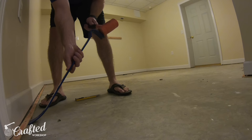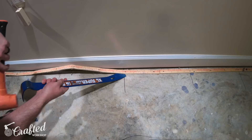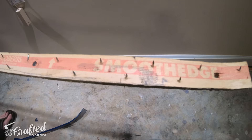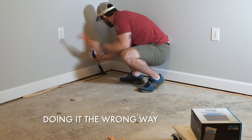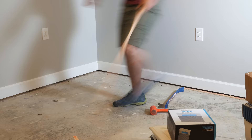These things are kind of a pain, but there's a method to removing them that makes things a lot easier. I actually picked up this method from my buddy Bob over at I Like To Make Stuff — he has some really great flooring installation videos you should definitely check out. The trick with removing tack strips efficiently is to hit your pry bar underneath each of the nails holding down the tack strip, but only just enough to loosen it. If you actually pry up on the strip it has a tendency to splinter into a bunch of pieces, which makes cleanup a lot more challenging. You can definitely move a lot faster if you avoid prying and focus on just popping the nails out. You can see how quickly it goes and how easy it is to clean up when the strip comes off in one piece.